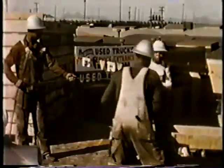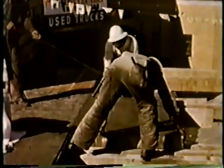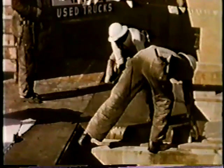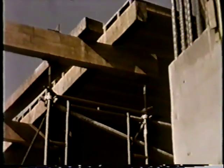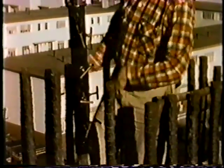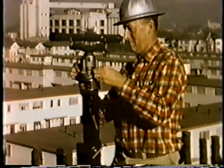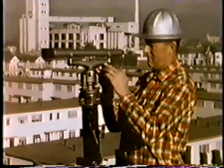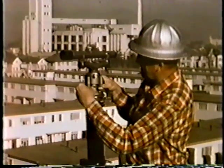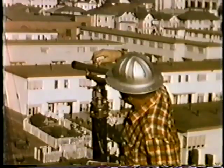Forms for the bottom slab of the superstructure were paneled units prefabricated in the contractor's yard. After they were in place, bridge department engineers cooperated with the contractor's men and set the soffit to proper grade. Our innovation, the unipod, was used to set up the instrument in a firm and secure location on a two-inch column dowel.